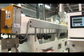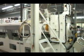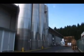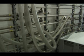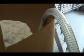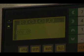The first step in the process is called extrusion, where the granules are heated to over 200 degrees centigrade, melting them down into liquid. New polypropylene is made from tiny pellets which are stored in massive silos and transported to the extruder by a network of pipes. Instead of putting new polypropylene pellets into the extruder, it's the recycled pellets that are sucked up and fed into the machine. In this run, it is 100% recycled material being manufactured, so the only material going into the extruder is the granules from the octabins.